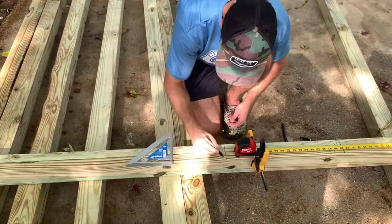After cutting all of the ProSlat panels to size, I took it back inside and I confirmed fit by tucking it into the piece of trim on the left-hand side and pushing it up against the stud on the right-hand side. Because that back right corner is gonna be covered by the perpendicular piece of ProSlat, I didn't use a piece of trim on the right-hand side. I then secured it to the studs after tucking the bottom of that piece of panel into the J-trim at the base. Then, just like before, you're going to slide each individual panel into place, making sure that it interlocks properly with the piece installed previously, and then secure it to each stud.